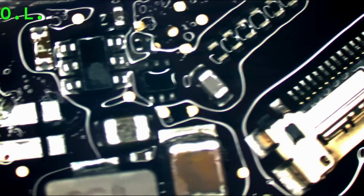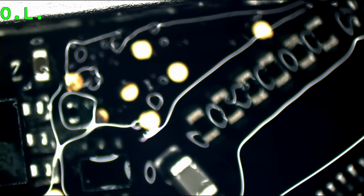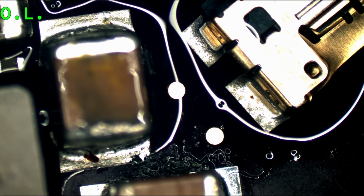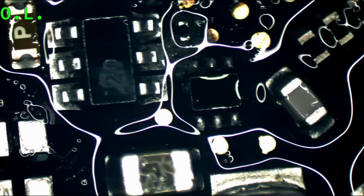And then you just go through every section of the board. What would be a warning sign to you on that, the one you just looked at? Yeah, if it was zero, or like 0.000. Okay. But that also had a K in it that you couldn't see on the screen. I suck at using OBS, but that was 3,000 ohms.